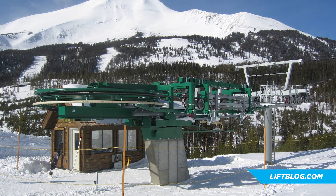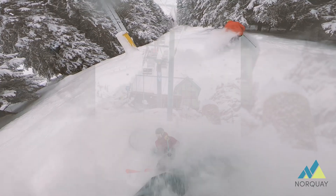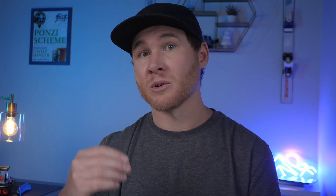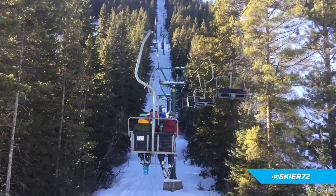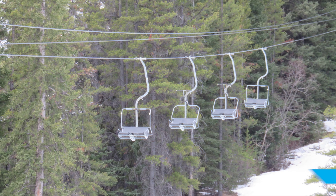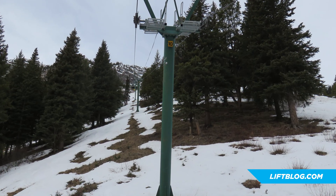However, both of these lifts run at 1,000 feet per minute at their peak, cutting the total ride time in half comparable to a high-speed chair. But what happens if you add more pulses? Let's swing up to Canada's Norquay. They have a really interesting double pulse here — probably the only one of its kind in the world. Their North American lift originated as a standard fixed grip double, but was later converted to a pulse double laid out with eight groups of four chairs. While this configuration, coupled with its shorter run length of just 3,000 feet, increases the uphill to 600, it greatly affects the speed. If you add more groupings of chairs, your uphill capacity can increase, but since you're having to slow down the lift more frequently, your ride time benefit goes down significantly. Also, the shorter the length of the lift, the uphill also increases. This lift maxes out at about 800 feet per minute, and with only doubles as carriers, is kind of limited for a pulse lift's potential.